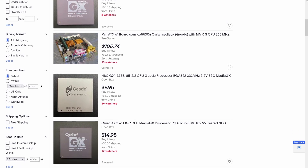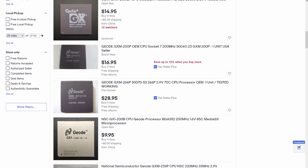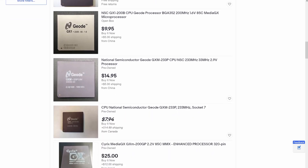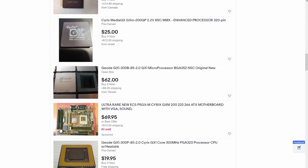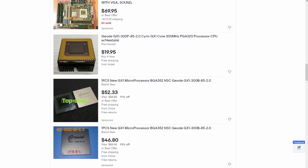As I mentioned before, the motherboard is compatible with three CPUs. The original MediaGXM, released before Cyrix's merger with National Semiconductor, available from 180 to 266 MHz and running at 2.9 volts. Then the Geode GXM, which is a rebadge of the MediaGXM in the same clock speeds and voltages. Finally, the Geode GX1, a die-shrunk GXM available in 300 and sometimes 333 MHz variants. The GX1 runs at 2 volts, but this board only goes down to 2.1, which actually ends up working just fine. The CPU and motherboard are all you need — VGA and audio are handled by the CPU itself.